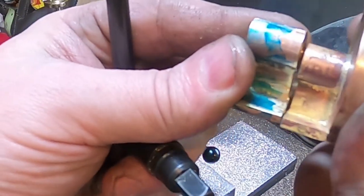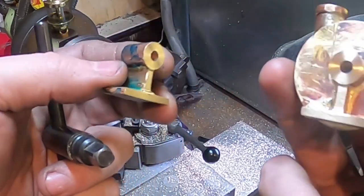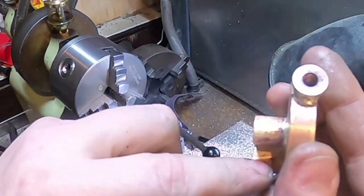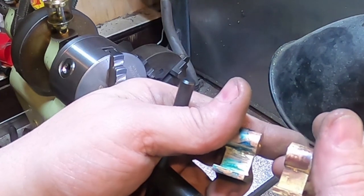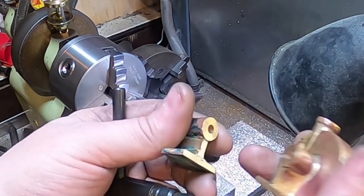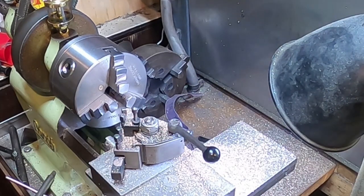So that's what we've got. That standard and that standard all ready to go. We've got this piece pretty much finished. It still needs a row of holes in it, and two holes to mount it down. This one's a bit longer as per the drawing. The pulley goes in between and a shaft across between the two journals. So lid back on's next.